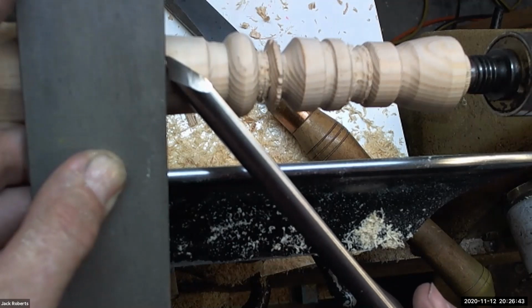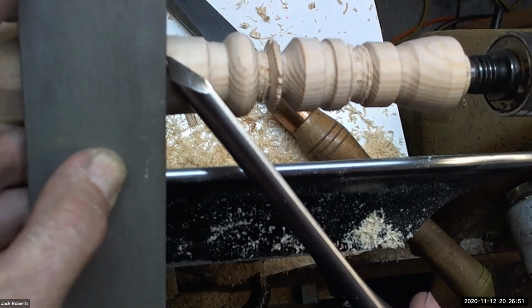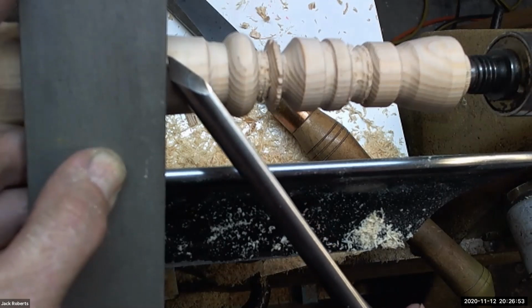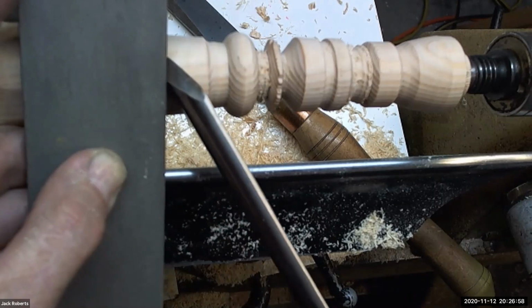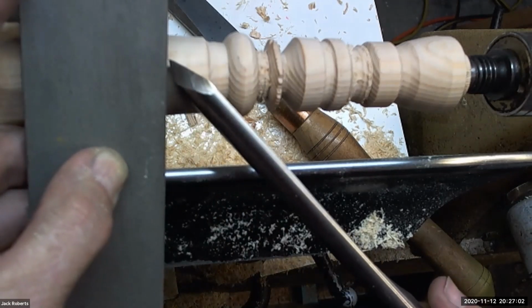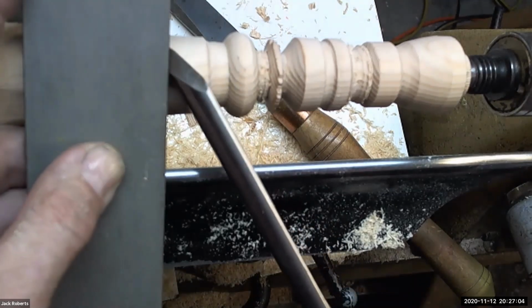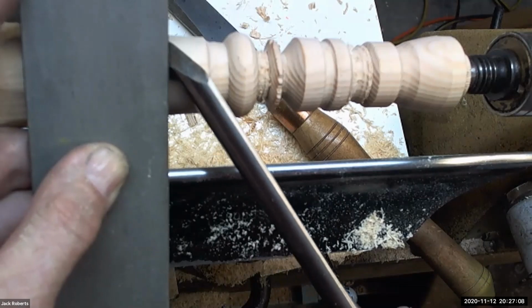Catch. You get, well, it may be. I mean, I do a lot of turning without a bevel support with a bowl gouge because they can get it in tighter spots. But that's where you get your catch. That's where it can't get a catch here, okay? And you're not likely to get a catch if the bevel is supported properly. You get up here and you're going to get a catch. So from the supported bevel back down, all that's in here is safe on this tool.